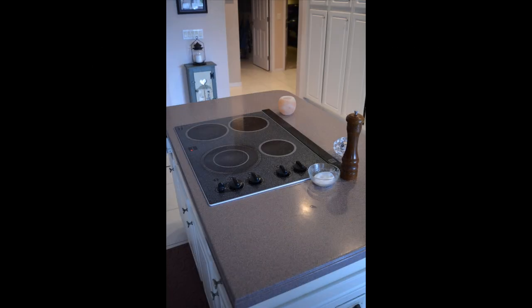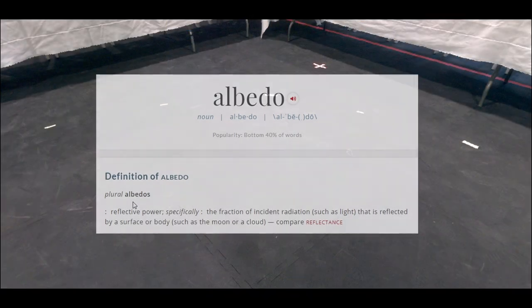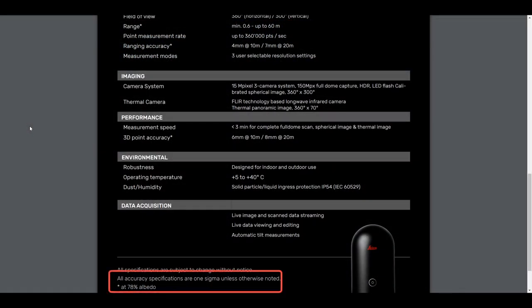The BLK360 can be used for a wide variety of tasks where it will excel at the majority of them. However, there are a few items or surfaces that can be challenging. This all comes down to two things when dealing with a laser. The first is mirror-like surfaces, which just redirects the laser off what you're trying to scan. The second is reflectability, which the laser scanning industry knows as albedo. If you look at the specification sheet of any laser scanner on the market, chances are you will see the term albedo as it relates to the maximum range, or how far the instrument can scan, and how accurate the instrument measures a distance, known as the ranging accuracy.